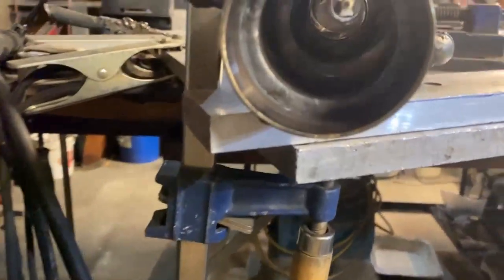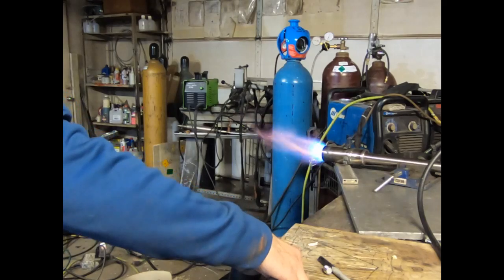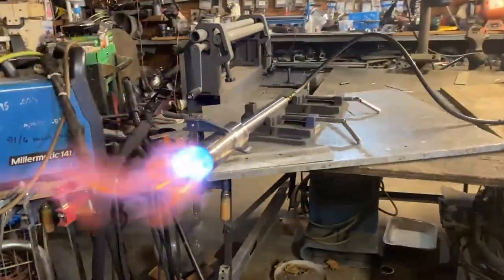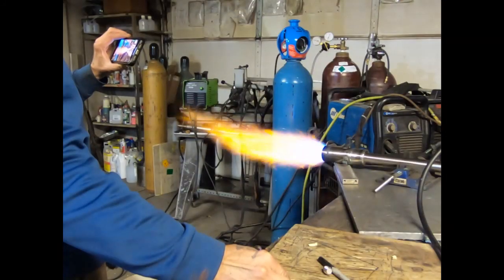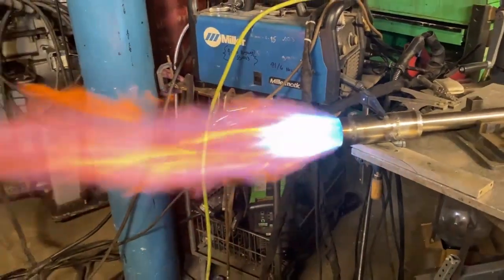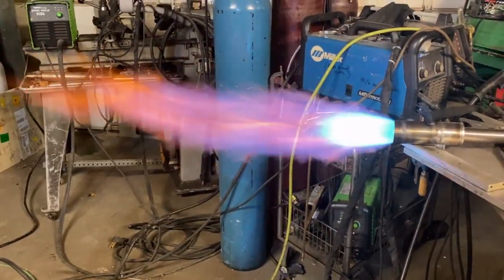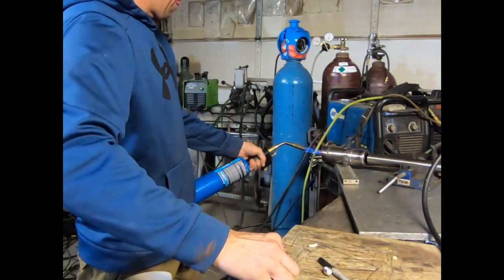Here's just your basic breadboard configuration — I've got this set up so I can move things around and quickly see what it does to the flame. The first setup I'm not really too excited about at all. We're pumping a whole lot of air, and if I turn the gas up too much it looks like it's burning back inside. It's not a bad-looking flame but it's not what I have in mind. Even turned up it's doable — this is probably about 600,000 to 700,000 BTUs — but I don't see them needing this much power.